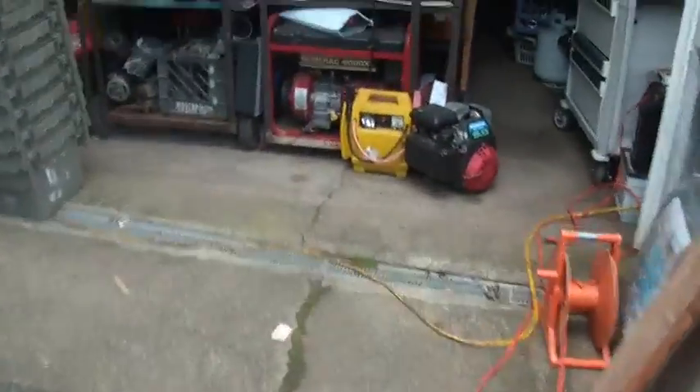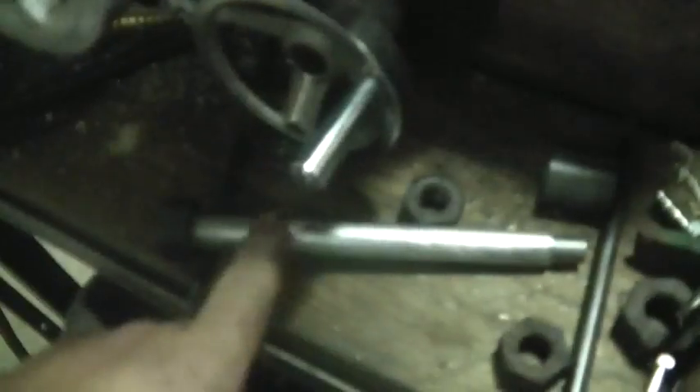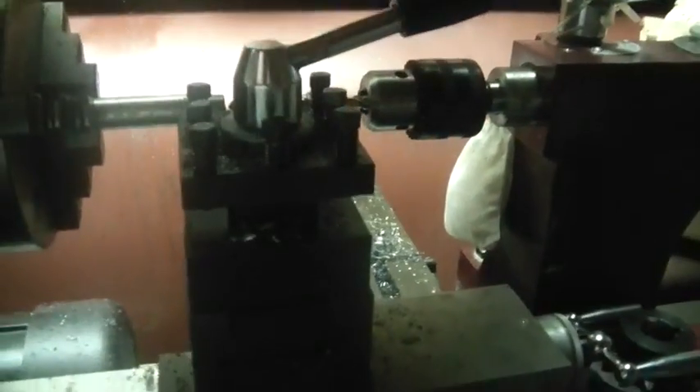I've got the lathe set up — let me show you what I did. A lot of times I'm asked, 'Can I see your lathe, can I see what's going on?' I have the Harbor Freight — sorry for the darkness, folks — I have the Harbor Freight 3-in-1. It's a lathe, it's a drill press, and it's a milling machine. This is the basement Horde, and here it sits. What I did is I have the remainder of the shaft chucked up. Get the chuck key out of that, and you guys can see it's just a matter of spinning it, then bringing the bit to bear and going back and forth until you cut the shaft down to the size you need.